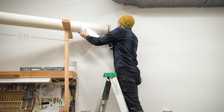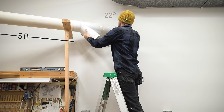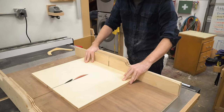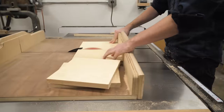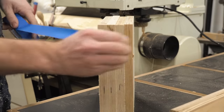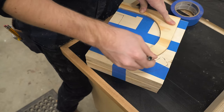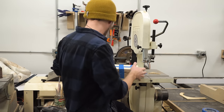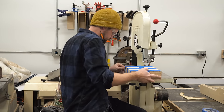I have a five foot straight run, which is the requirement of the dust collector, and then that meets the wall at a 22 degree elbow. I knew that I needed some sort of holster or bracket to hold these things on the wall and I didn't really want to do metal strapping. A lot of people do that, but it's not a great look, so I decided to design my own bracket and just made these out of a piece of scrap plywood. It was a little tight in the shop with all the tools pushed in the corner, so I had to sit on my thickness planer to cut this thing out.